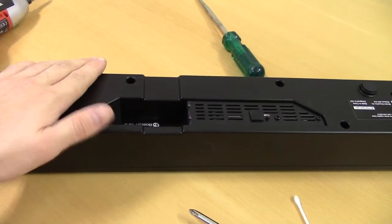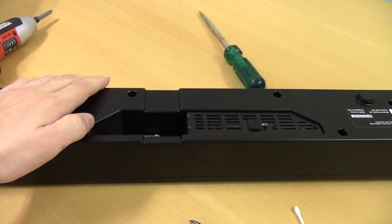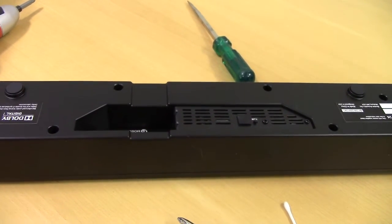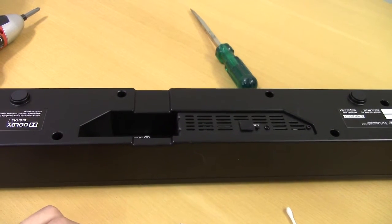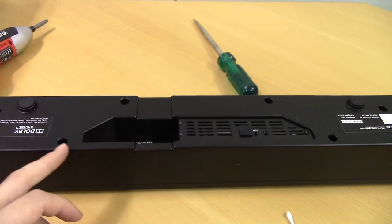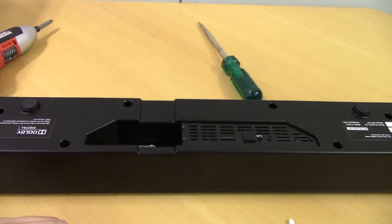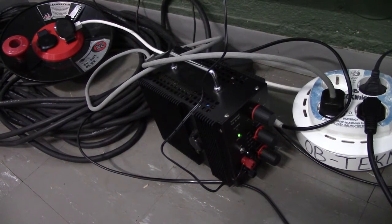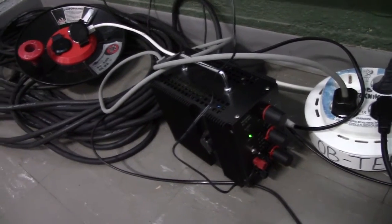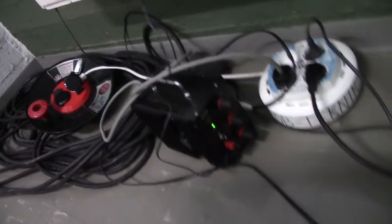The one I've used for testing has been a 16.5 volt supply, or 16 volts even, rather than the 18 that it came with, so might be a bit of an issue, might not. I would not imagine it making an issue, since it's probably bucking the voltage to 12 volts or so. On the back of a laptop power supply with a standard plug on it, we've got a little LED power supply. It'll do just fine. A little 2 amp job this.